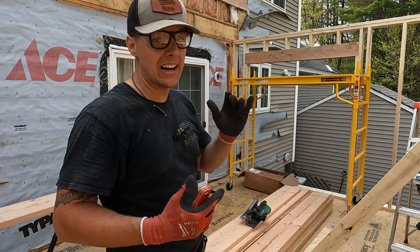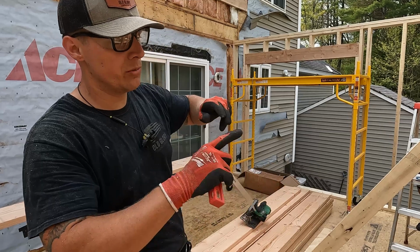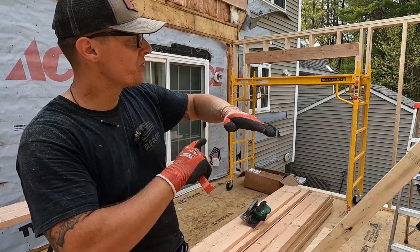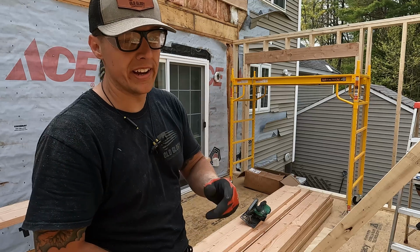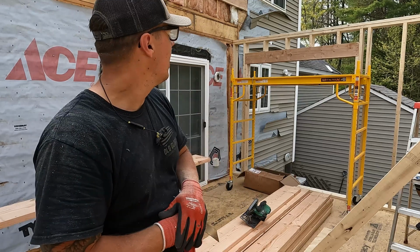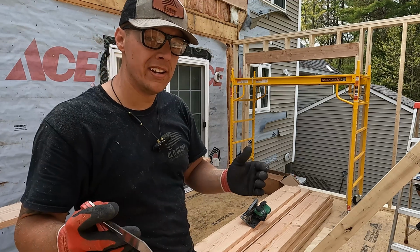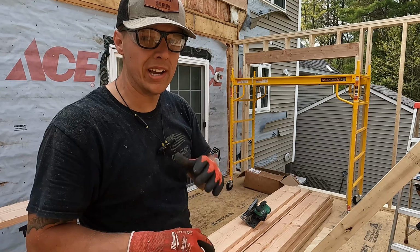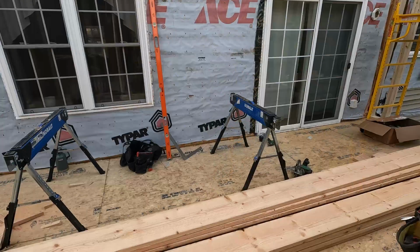And then I went ahead and copied the seat, which is level, out 12 inches, and then I gave us a plumb cut there to give us our sub fascia point. So yeah, we got our template set, and we're gonna get cutting. We got 19 rafters and 2 flies, so let's get it.